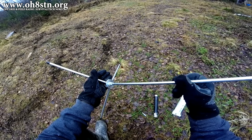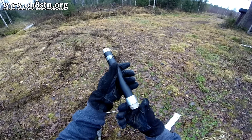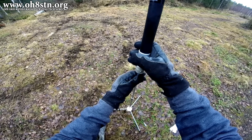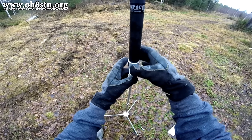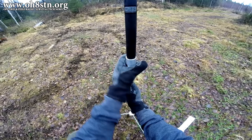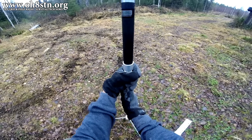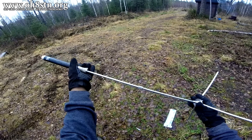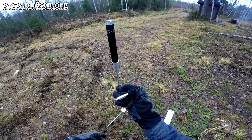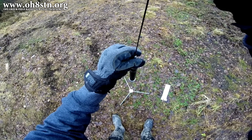I find it easier to deploy the system from the bottom up: the tripod, the extension rods, the slider, and so on. Now we can go ahead and pick up that Super Slider — we're going to put the side with the coils down. Go ahead and thread that into the top of the extension rods and tighten it from the bottom of the coils. Grab the Super Slider at the base of the coils and the TM1 at the base and give it a twist. Once that's done, go ahead and pick up the SW-1 Titanium Whip and place it on top of the slider.